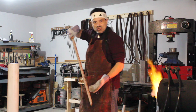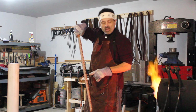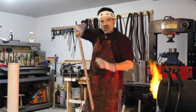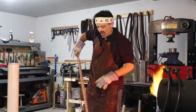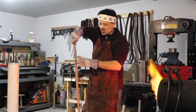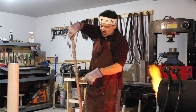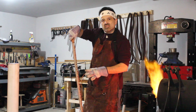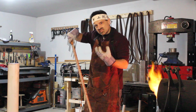First of all, to set up differential heat treatment. In essence, the areas of red clay closer to the blade, or the ha, are going to be heated at a higher temperature and cooled at a much more rapid rate than the areas with the gray clay. This is what's going to allow the blade to get hardened and for the spine and the shinogi section of the blade to remain soft. You'll also notice some licking striations coming down. In Japanese, that's referred to as ashi. What that does is relieve stress in the steel. It also helps provide for a choji, clove blossom style hamon.